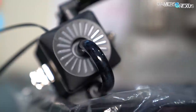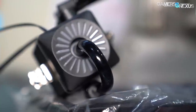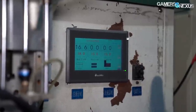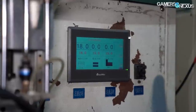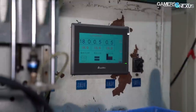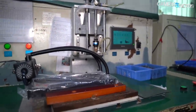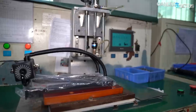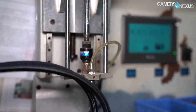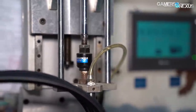The cooler next moves to the infusion machine, which vacuum seals the cooler for a couple of seconds to make sure it's airtight, then uses simple pressure to suck liquid into the cooler and the radiator from an external tank filled with liquid. Rather than filling the cooler forcefully, pressure is used to pull the liquid in. The coolant is typically propylene glycol — the common industry use is about 20% propylene glycol to distilled water in these types of products, although that spec can change depending on application. Some go as high as 40%; it depends on cold tolerance, heat tolerance, and sticking closer to a lower percentage propylene glycol will improve cooling efficacy. It's just a trade-off of what performance or endurance elements you want in the cooler.